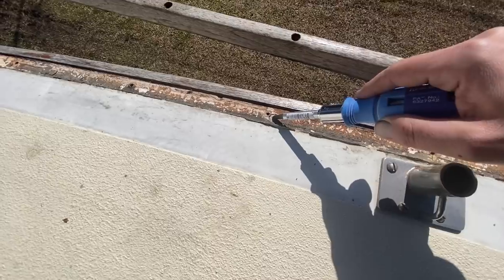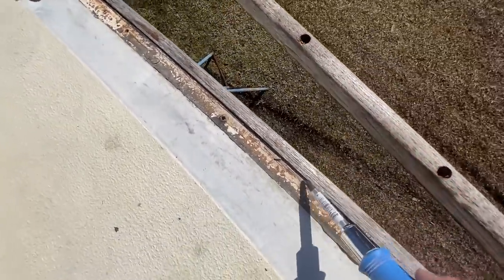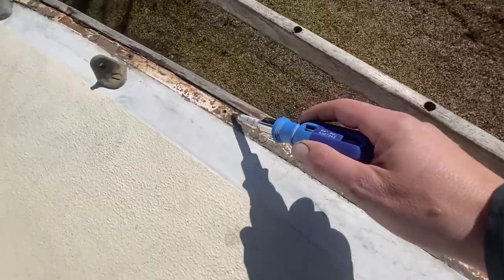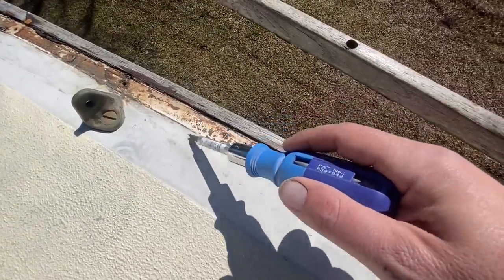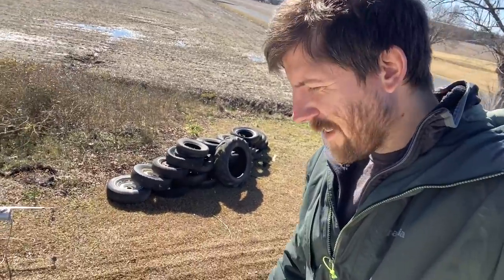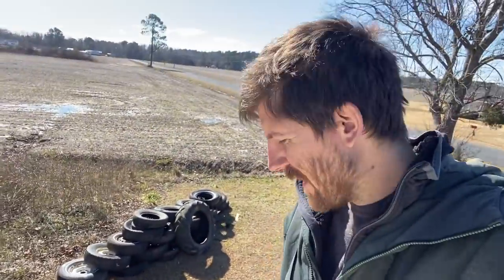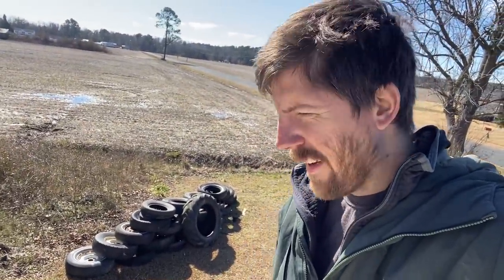glued and it's bolted down into the hull, and this area along here, there's a flange, but I think there's water coming in through there. And then of course all of these. So unfortunately, I think what the best thing to do will be to kind of grind all this smooth and get down to the glass, and I'll put another layer of fiberglass over that.